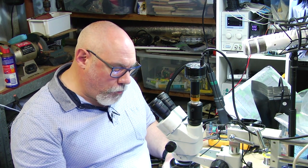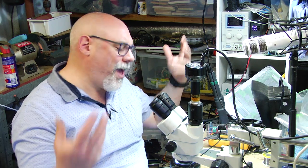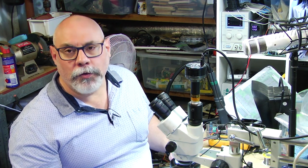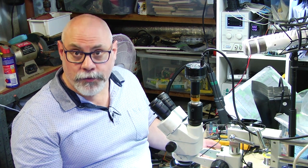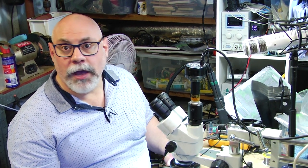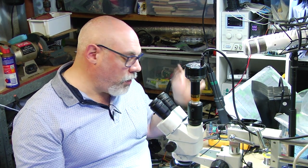So a lot of the time people jump on the forums and they go, hey, my Color Classic stopped working. And then the first response you get from people is, has it been recapped? And it gets a little bit tiring to hear that. But at the end of the day, that is the first thing that should be done. If a Color Classic is not working and it hasn't been recapped, your capacitors are probably about a 90% chance they're the problem.